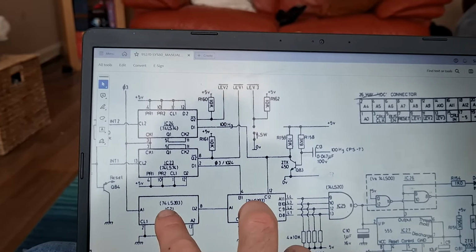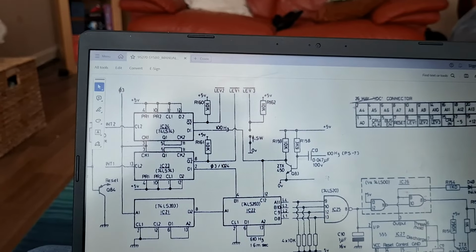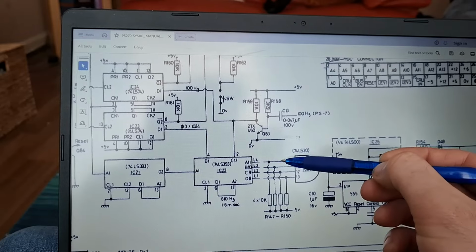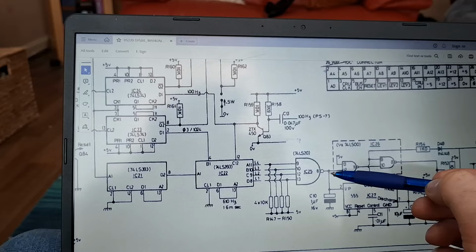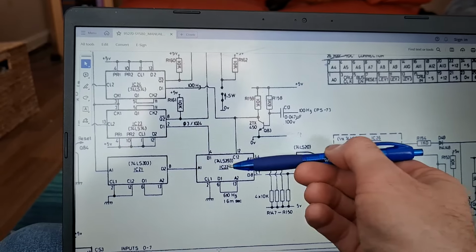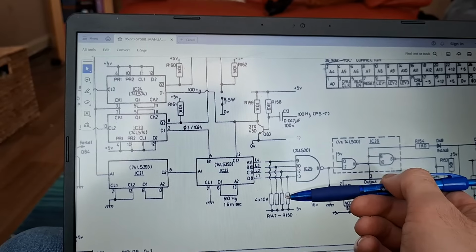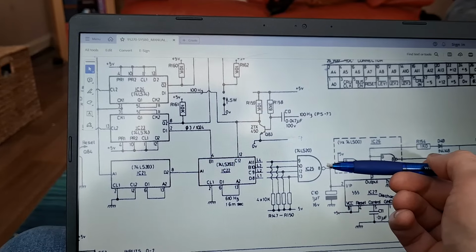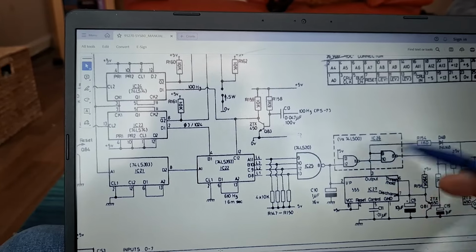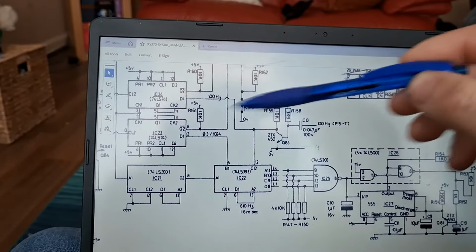So the aim of this here is, they can't be allowed to count up to a certain amount before it resets. And what they do is, they've got a 4-input NAND gate here, not AND, which means that if all of the inputs are high, the output goes low. If any input goes low, the output is high. And what they do is, the outputs of the counter, you can link certain combinations to pull some of these low and keep this high. See how this is into the trigger of this timer? We'll get back to this in a minute. So your 100 Hz is coming in here, resetting this 100 times a second.